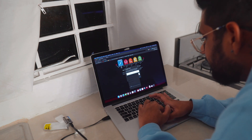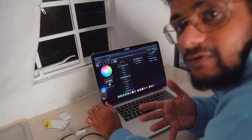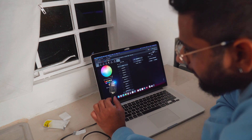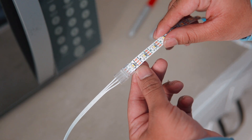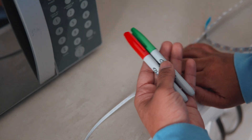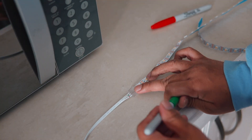Connect it to your Wi-Fi when this box pops up. I know you can't see everything that's going on on the screen, but I promise you it's that simple. Now a quick little test we can do to make sure everything's working — hit this power button right here and you can see this LED turn off. Hit the power button again and it turns on. Now we just need to connect the rest of the LEDs. But before we do that, we have three wires: positive, negative, and data. A Sharpie is going to be my best friend because they're using white wires.